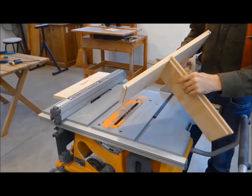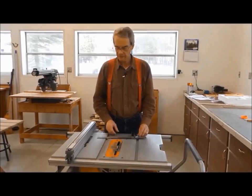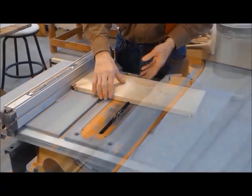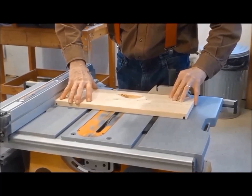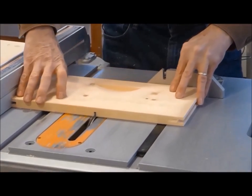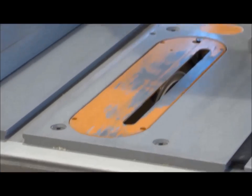Before you make the cut, double check to make sure that the groove is exactly centered in the middle of the board. Here is a sharp tip to exactly find the middle: first, position the fence as closely as you can by measuring with a ruler. Then slide the board up against the blade and take just a tiny nibble off the edge — all we need to know is the location of the dado. Then, keeping the same side of the board down, turn off the saw, rotate the board, place it behind the blade, and slide the tiny notch up against the blade. The blade should exactly match the location of the notch. If it doesn't, move the fence half the distance that the blade is off. This technique will assure an exactly centered dado each and every time. The dado blade is now set for an eighth inch wide cut raised to three-eighths of an inch, and we can cut the dados on the end boards. Again, make sure these dados are exactly centered, then complete the job by cutting the dados on both sides of the center partition. Note that these dados are three-eighths of an inch deep and stop just up against the back of the frame rest, so when we slide in the two lengthwise partitions, they will butt up against the back of the frame rest with no gaps and be bee-tight.